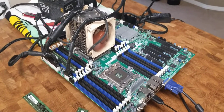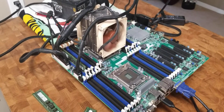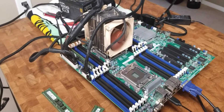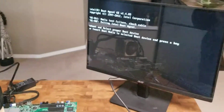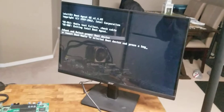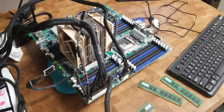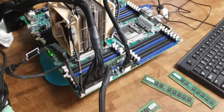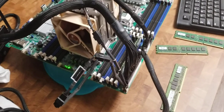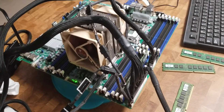Sometimes motherboards are smarter and can downclock memory to match a processor. I had all four sticks in, maybe that was asking too much of the CPU. So I tried just one stick, and we got magic — it booted. The system reconfigured the one stick to the supported memory speed. Now I should be able to flash the BIOS and possibly the IPMI firmware version as well.